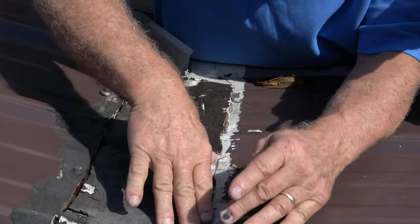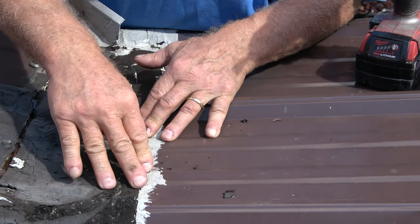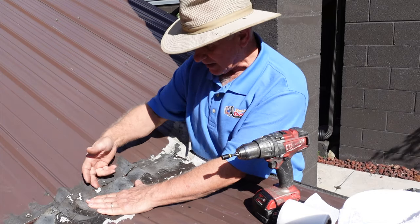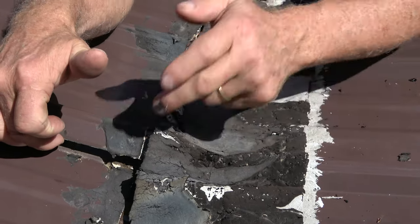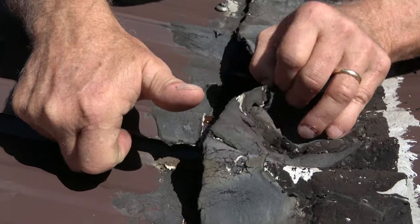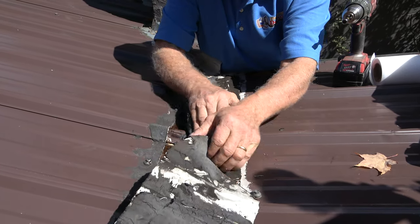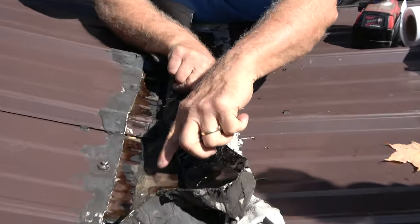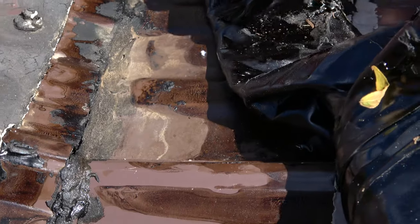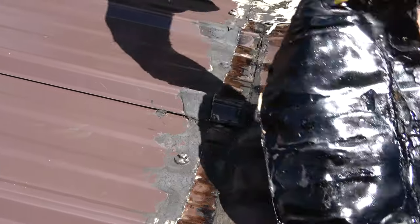What happened is the water was, this was sticking so good to the roof, but this side opened up a little bit, and especially where this is, you see this, look at this, he was sealing this, but he could not seal behind there, and water would get in there behind this tape, and this would be sealed, and it will push the water back underneath here, and you can see the dirt there. Look at the brown water marks, you see there, brown water marks. All this was collecting behind this tape and pushing it up here. So we need to fix this so it cannot happen.